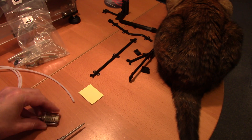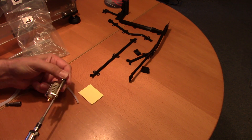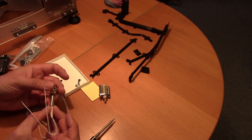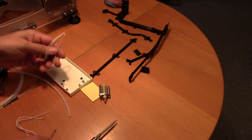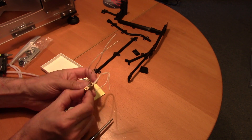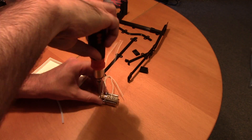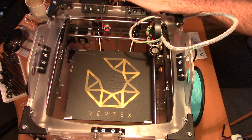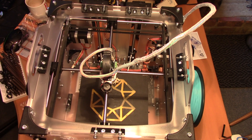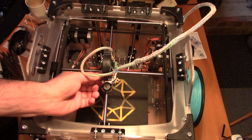What I'm doing here is assembling the additional hotend and the extruder for it. The instructions that Velleman provide are very detailed and the photos they give are pretty much identical to what you're seeing here. You have to measure a piece of PTFE tube, fit it in, put all the screws in, put the thermistor through the heat block and the heater cartridge in there, wind the wires in, push it all together, and put some more screws in.